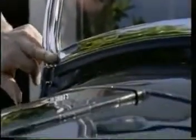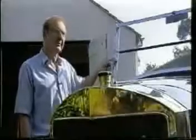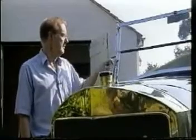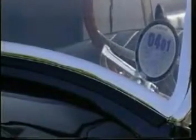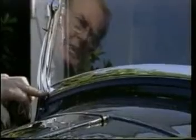This windscreen, for example, was made originally from a pressed steel construction, very cleverly, and of course it would be impossible to make in a normal workshop. So I machined them out of the solid. I've got some pieces of steel, as you can see here, milled a slot in where the window fits in, and then a friend of mine heated these up and bent them to fit the windscreen base moulding, as you can see here. Welded all the bits together, polished them, buffed them, and then sent them away for chromium plating.